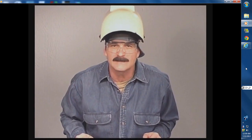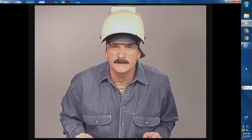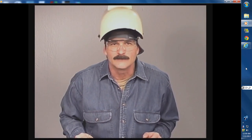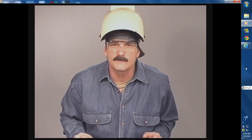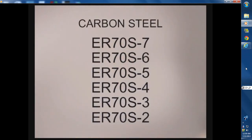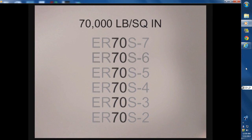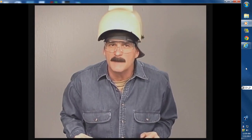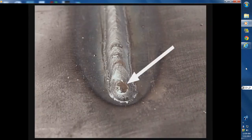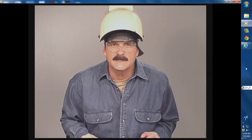With the increased use of gas metal arc welding, many filler wires and shielding gas blends have been developed. The most commonly used filler wire for welding on carbon steel is ER70S6. All these wires have a 70,000 pound per square inch tensile strength — indicated by the 70. Tensile strength is the force it takes to pull it apart. The difference between filler wires is the type and amount of deoxidizers — chemicals added to help clean surface oxides and gases from the molten weld, leaving small slag deposits. ER70S6 contains higher amounts of silicon and manganese; while a little more expensive, it produces quality welds in different welding situations.